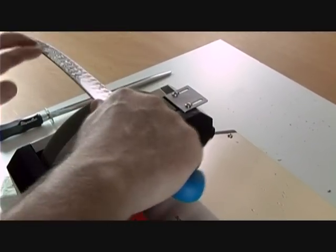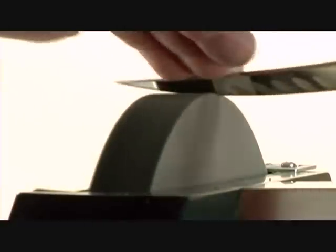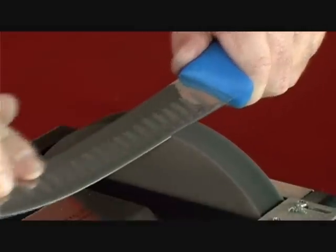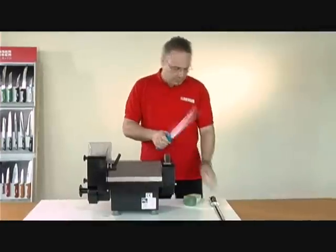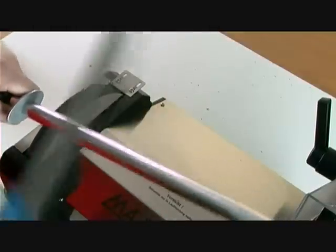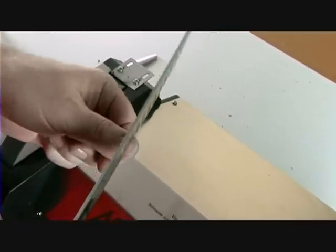After the rough grind, the burr on the blade must be rubbed off on the polishing wheel. Polishing or sharpening paste is applied to the polishing wheel, and the blade is then passed over the polishing wheel several times from both sides whilst applying a gentle pressure. Afterwards, either a polishing steel or a hand honing tool may be used to finalize the edging. A perfect finish for a blade.